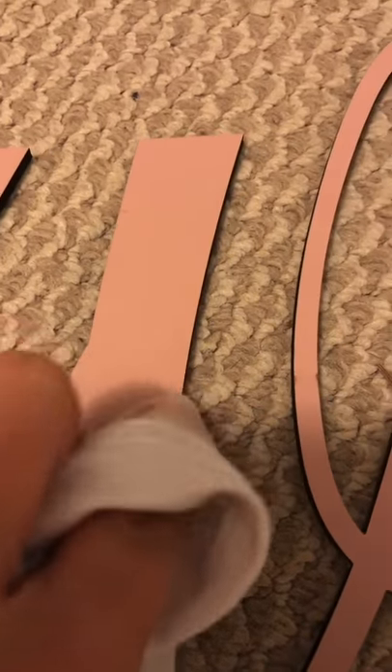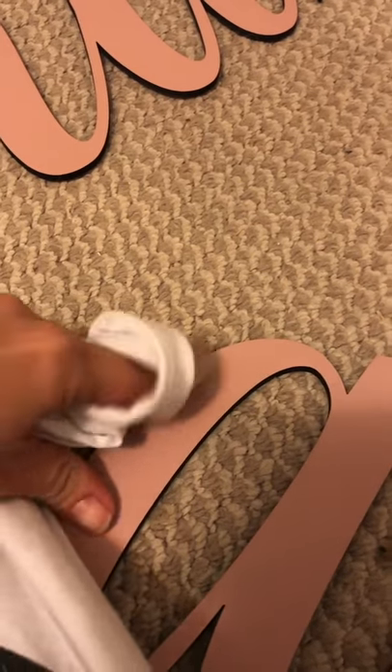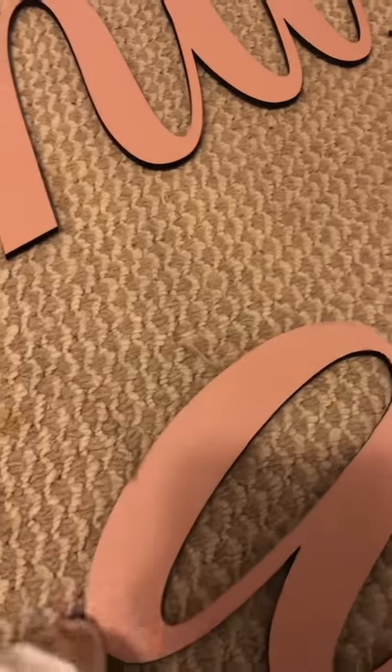She looks great — just peeled off the masking. But there are just a few spots where there's a little bit of a burn mark from the laser. So I'm gonna take my rubbing alcohol and just an old t-shirt — that's just gonna come right off. I'll do that in any of the spots I notice. Some are more noticeable than others, but it comes right off. Done — then I'll clean it up and I'll be done.